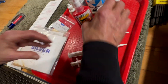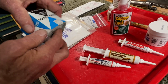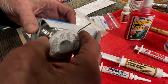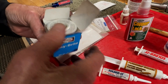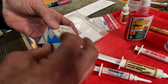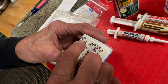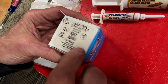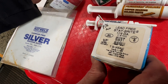Here's another form that looks like electrical solder the way it's packaged. This is good stuff made by Harris, called Stay Bright, and it's used a lot in HVAC — for example, repairing an air conditioner. I looked it up and it's 4% silver, so this would probably be stronger than the Ace Hardware stuff we were just looking at, which was 2%.